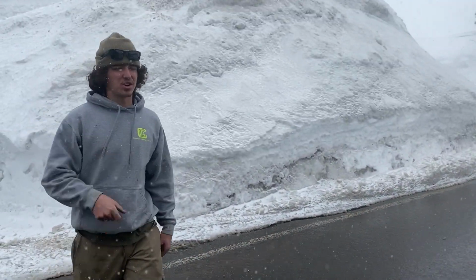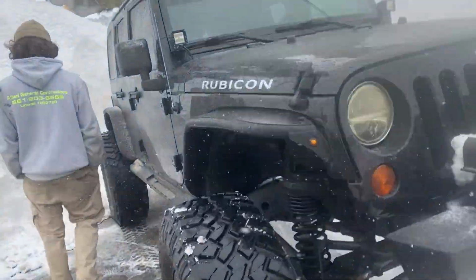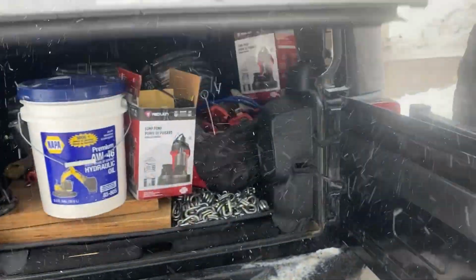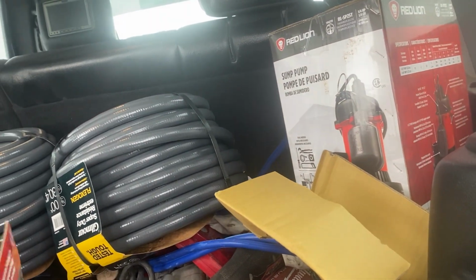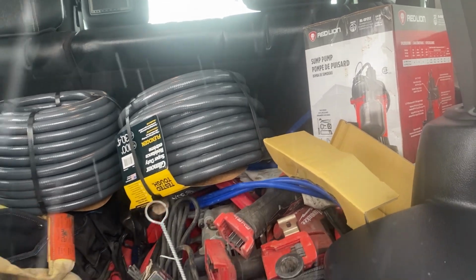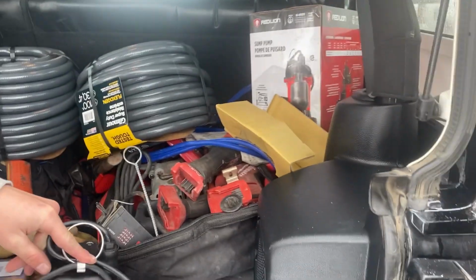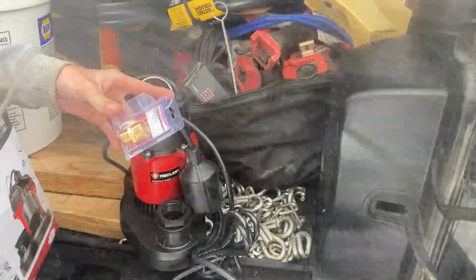Pumps, huh? Those pumps have an inch and a quarter thing, so I had to buy a bunch of adapters to make it work. Wow. Let me see the pump. See what it looks like. They should have the right size for a hose on them in the box. I opened it. They didn't have extra ones in the box. Did you check? Yeah. So I got this 1¼ to 3/4, and then put the 3/4 in, and then you can thread the hose on. Huh. Yeah, because typically they have all that in the box. They usually have a couple fittings in there. Yeah, they didn't. I don't know why. I had to get a 1¼ to 1/2, and then get a 1/2 to 3/4 because they didn't have another one.